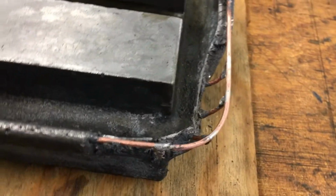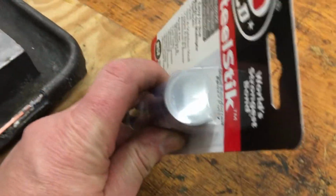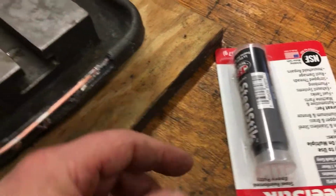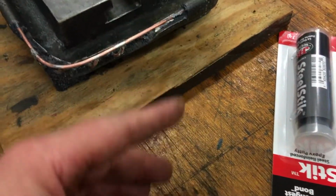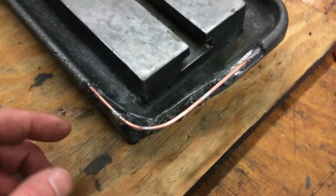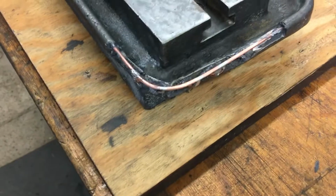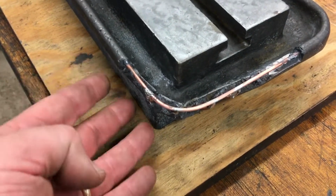And now I'll go back in and put this steel stick in. I mentioned before that I thought maybe I wouldn't do that because it was so expensive. This is what I'm talking about. It's a putty. If you look in, well, you can't quite see it. It's two parts wrapped around it. So you cut off a piece and you mix it together. It's real sticky, and it's an irritant, so you have to use gloves. And then you put it in there, and it's sort of like clay, and it sets pretty darn fast. And then it has very metal-like, cast iron-like properties.